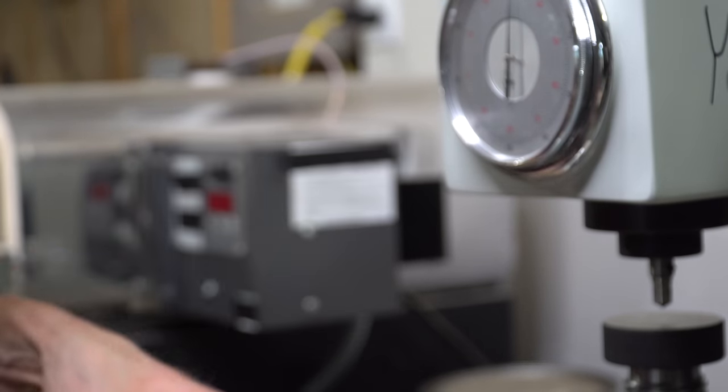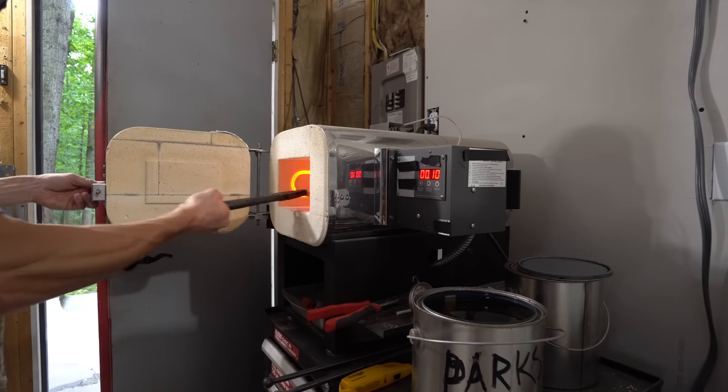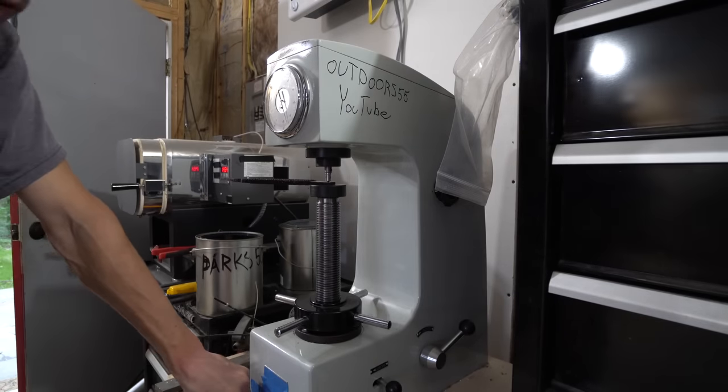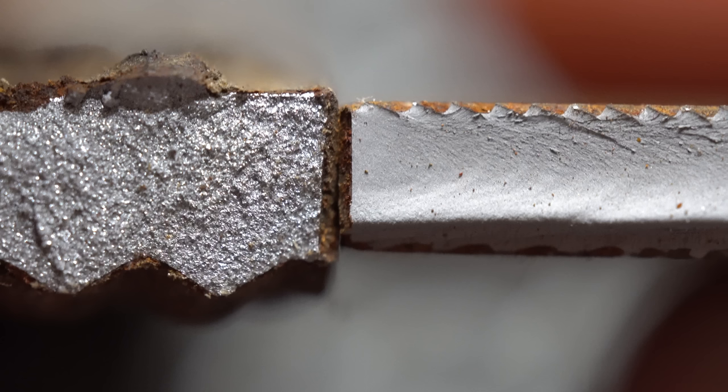We're ground down just under the surface here — we'll see what this reads: 44 and a half. The false through-hardened file cannot be reheat treated very well. I tried running an anneal and re-hardening to no avail. The hardest I was able to get it was around 55 HRC after quenching. After grinding through the decarb layer, we got 53 to 55 Rockwell. The best way to identify this type of file is to analyze the grain structure after a snap test. If the file has large, very coarse grain, I'd stay away from it.